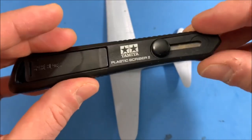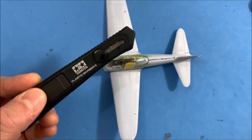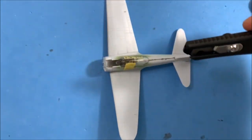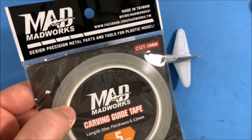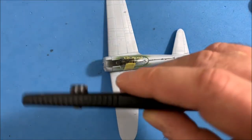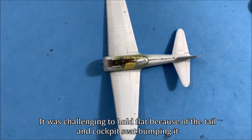This scriber works really good. It is easy to dig in a little too much into the plastic if you use too much pressure. So just very lightly going over that line using guide tape — putting the guide tape down and then very lightly scoring it using just the weight of the scriber to get that line in there.